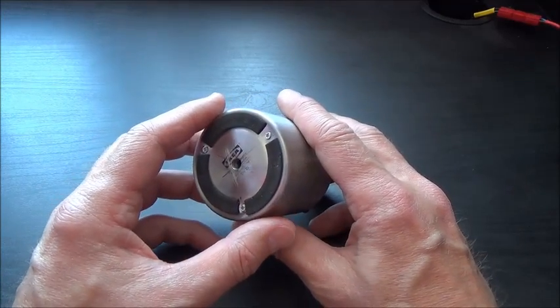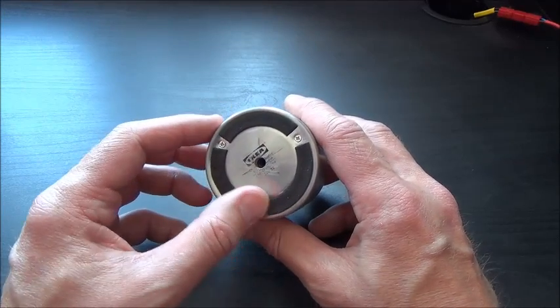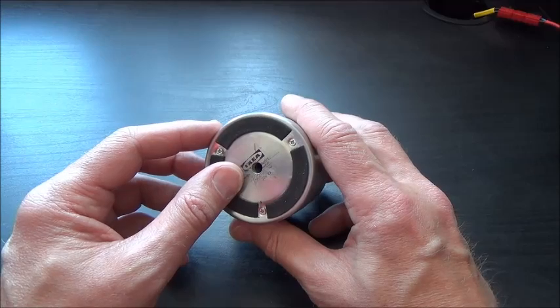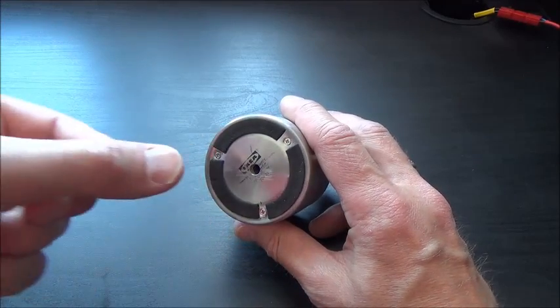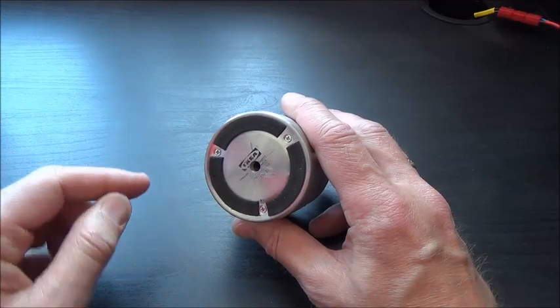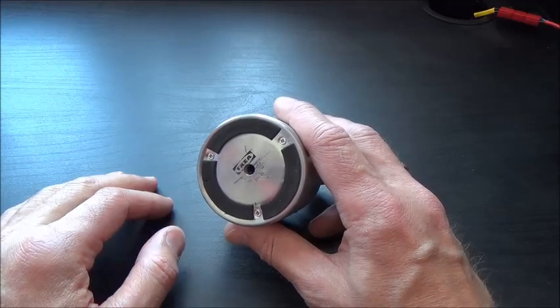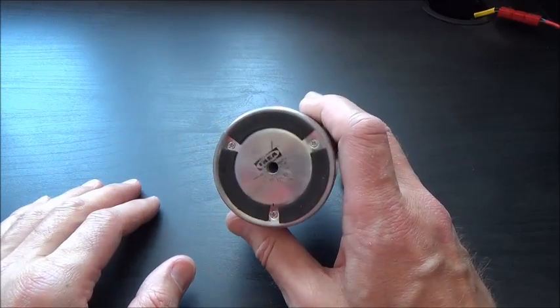What you do is heat up a square nut — just the right size for your camera tripod — using a heat gun, then sink it into the plastic. It just sinks in; you let it set and it stays in nicely. You can put a bit of super glue in there as well if you like, then file it all off once it's dry, cooled down, and set.